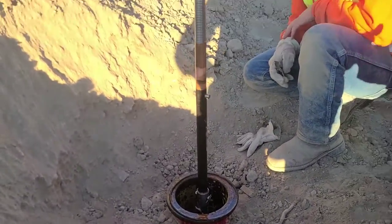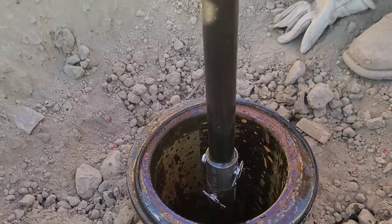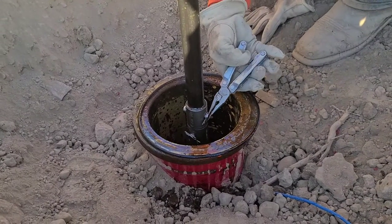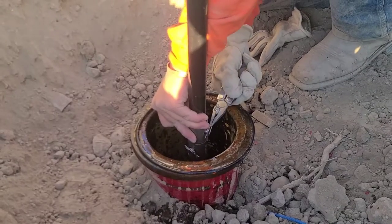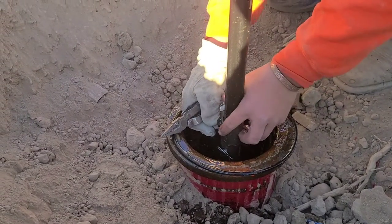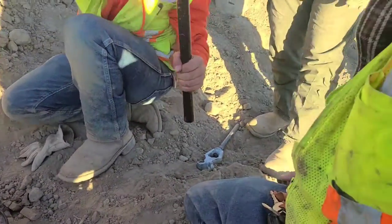Now that we have the hydrant off, we are going to pull the top pin on this. It is very important that you do not drop any of that down inside, or we have to go to the store to get new parts. So now we're going to pull the pins very carefully — I usually use pliers so that we can hold on to everything. Then we're going to pull the main pin out very carefully. Now we can pull this rod out and we're going to set it aside somewhere where we're not going to get it dirty.